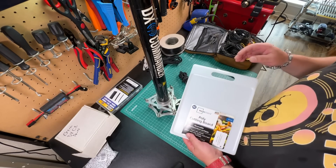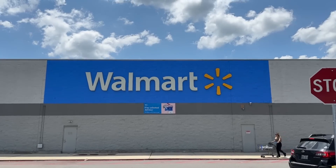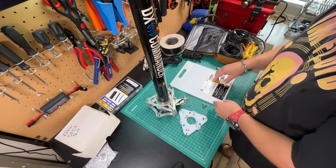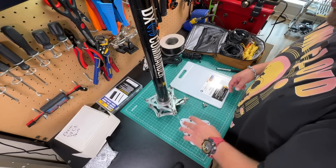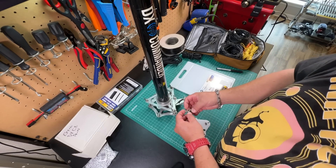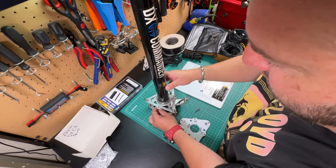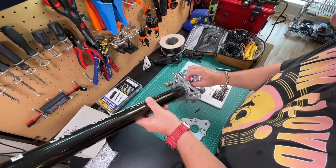I've got some spare parts and we are going to attach our 30-meter element right there. I went to Walmart and got a cutting board — they don't have the $0.88 one anymore, I spent $2.77 on this — and we're going to draw out some kind of spreader and go cut that. Then we'll have an all-band DX Commander Expedition: 40, 30, 20, 17, 15, 12, 10, and 6.